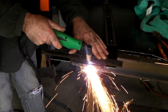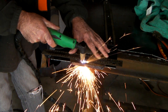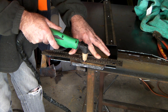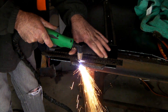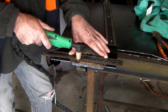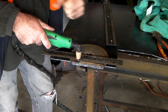My compressor may even restart when I'm cutting this bit - there you go, see that, the compressor restarted. And there you go - blew the whole lot out of the garage. The circuit breaker for the plasma cutter and the compressor just blew - it can't handle both at the same time. I'm dragging so much air out of the compressor it just can't handle it. A bigger storage tank means the compressor has to restart less often.